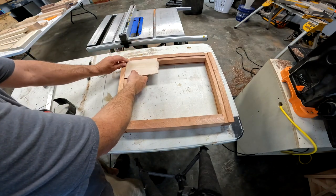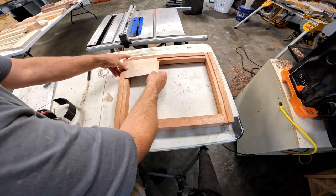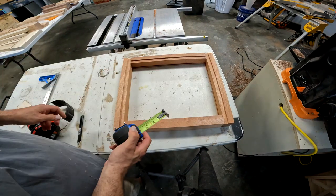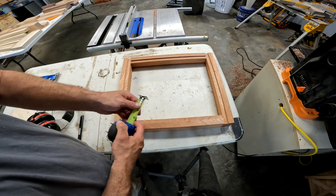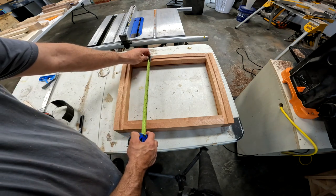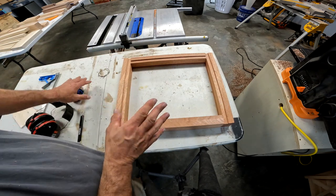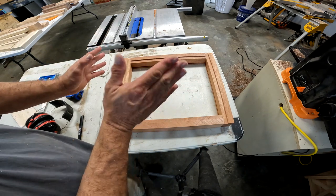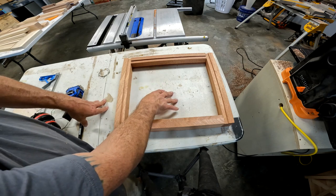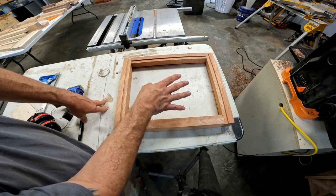Comment below how to get rid of these blowouts besides packing them in later. What I want to do is cut my back in first, then cut my board in for the bottom. I want to measure my back and my inside front face. I've lined these up by hand — I'm at 13 and a half by 16 and a half. I'm going to cut it a little bit bigger because I'd rather snug it in place and shave a little off than cut it too short. Both pieces should be exactly the same because I've cut the grooves on the inside the same depth as the grooves for the back — two pieces, same size.